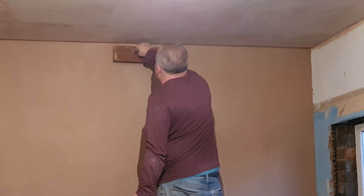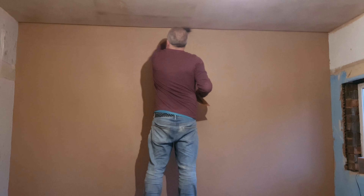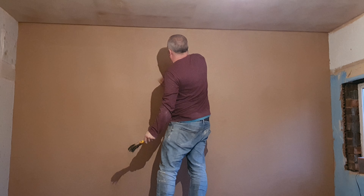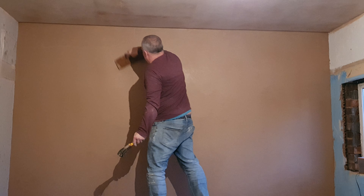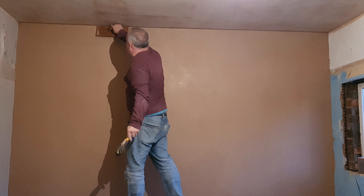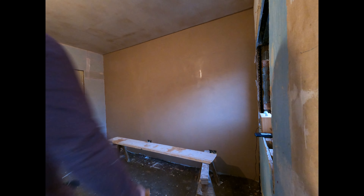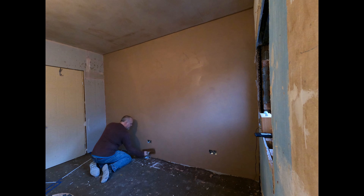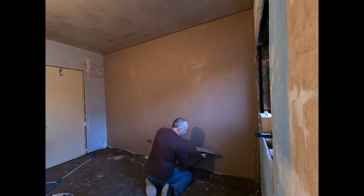This is the final pass — another 20 to 30 minutes has gone by. Use a wet brush for this one, going over it one last time. Tidy up around the edges at the top with your float; if you've got any muck on there, brush it in — it really neatens it up and gives a perfect seam. You'll learn where you need to apply water — splash it on and spread it around. You can really see this is the final trowel; it feels flat already and is filling in the bits you just can't see.